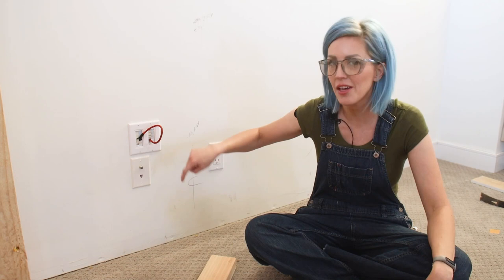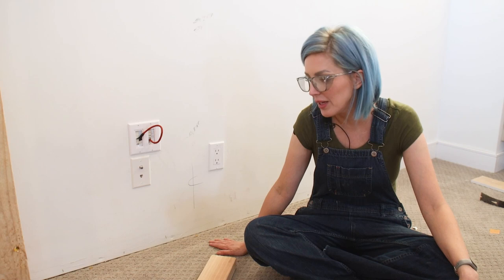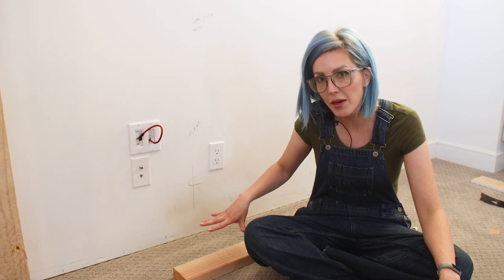You may have noticed that we are not pulling up the carpet in the area underneath the fireplace — there's a reason why. We plan on being in this house for a long time and knowing ourselves, we may eventually change up this fireplace, so we want to make sure the original carpet is still where it was laid. We are going to build our wood framing right on top of the carpet. This fireplace won't have much uplift — all the weight and force is going to be pushing down onto the carpet and floor below. We might get a little settling as the pad squishes down over time, but it's so shallow it's probably not going to be noticeable. If you're really concerned, you can always nail through your 2x4s through the carpet into the subfloor below. Even if you don't have studs aligning with your fireplace, if your house is wood-framed there's always a top and bottom plate you should be able to nail into.